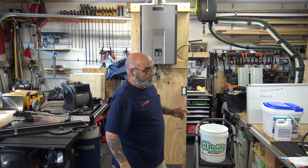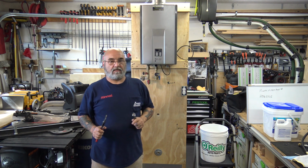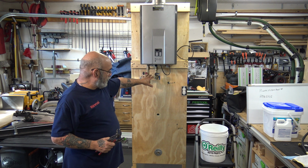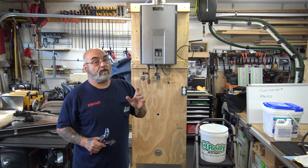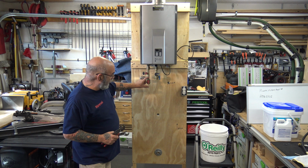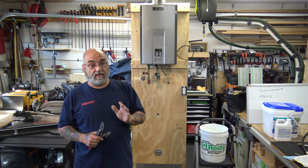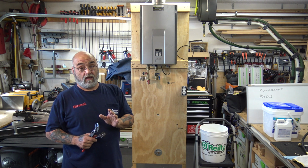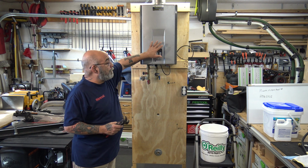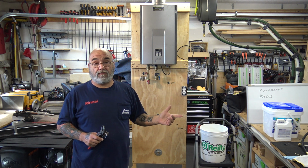All right. Now, watch the age of the tankless. These service valves are very good, but there are some that have a big aluminum handle, white metal. You've got to watch, because I won't service a tankless that's really over 3 to 4 years old. For one, there's been a lot of abuse to the heat exchanger, and there could have been a leak in it when you pump this stuff through.